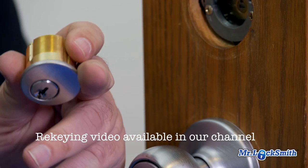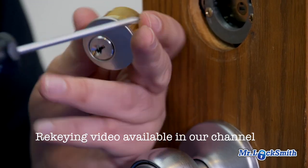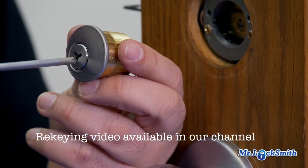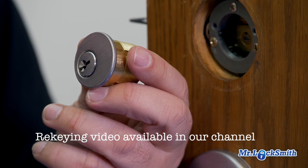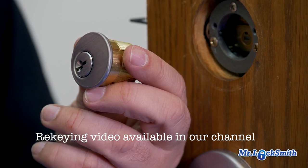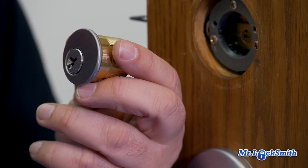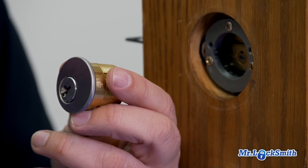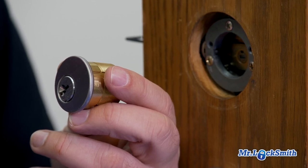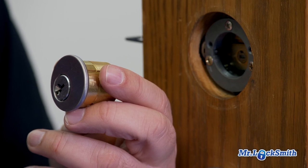So again, any mortise cylinder, these are pretty standard. It could be a 1 inch, 1 and an eighth. And it could be any keyway you want, from regular residential right up to high security and commercial. But don't let this fool you, I would not install this lock. We run across them because there's lots out there. Would I use these? Nope. There are better solutions. It's easier to install and more reliable long term.